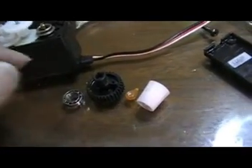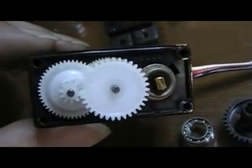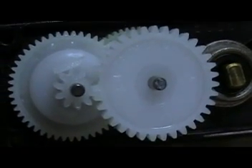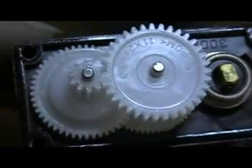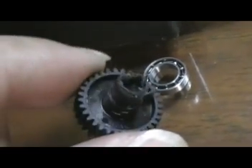I've opened up the second servo. This time the second gear and the third gear were destroyed. You can see the small pinion gear on the third gear — the second and the third. Here's how I do it: I drill a hole to make a thin walling, then pull out the bearing with just your fingernail.